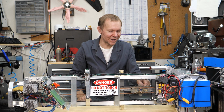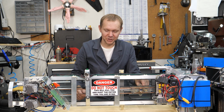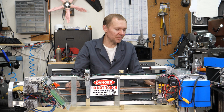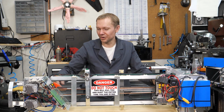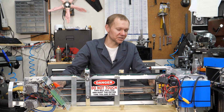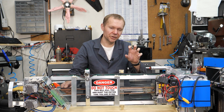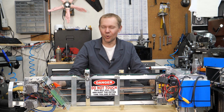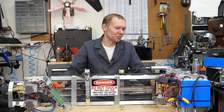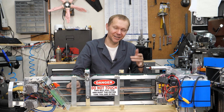And so I put one notch on the diameter of the solenoid. And what happens is we mounted this micro switch where this thing rolls back until it finds the micro switch. You get a little click. And then as soon as it gets the click, the controller, the way my son did the program, goes ahead and slows down and keeps going until the solenoid is rotating and the notch lines up with that switch, then the switch releases and it breaks the contact. And now, in basically one operation of moving the motor, the upper one is the one we chose, we're able to get both position and the orientation, the clocking of that solenoid.